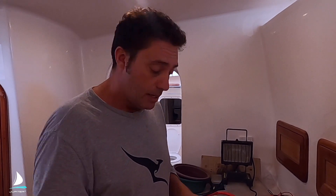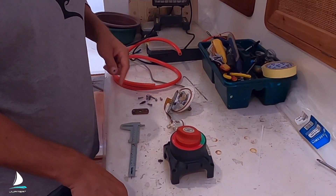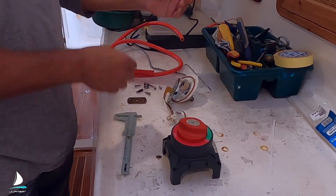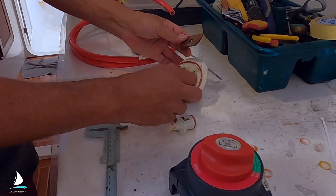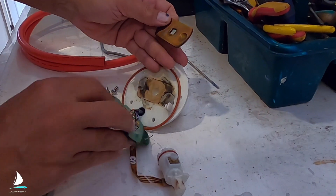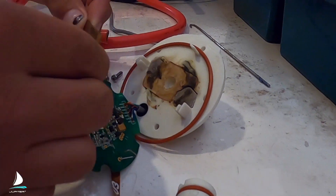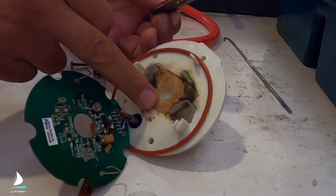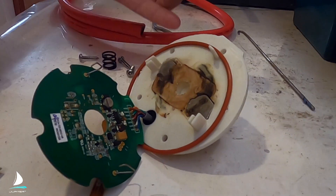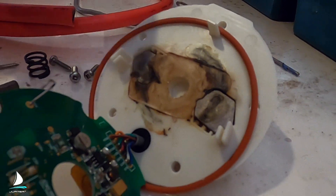What's happening is that they are overheating. This one is rated at 600 amps continuous, I think 1500 amps intermittent or cranking, and the contact plate gets so hot that it melts the plastic it's sitting on. I've had ones that have welded the contact, and this one has just melted the plastic — and the plastic has covered the contact so it no longer makes any contact.